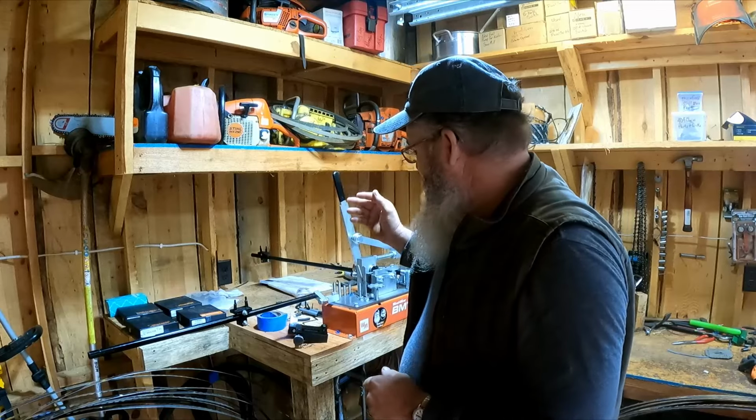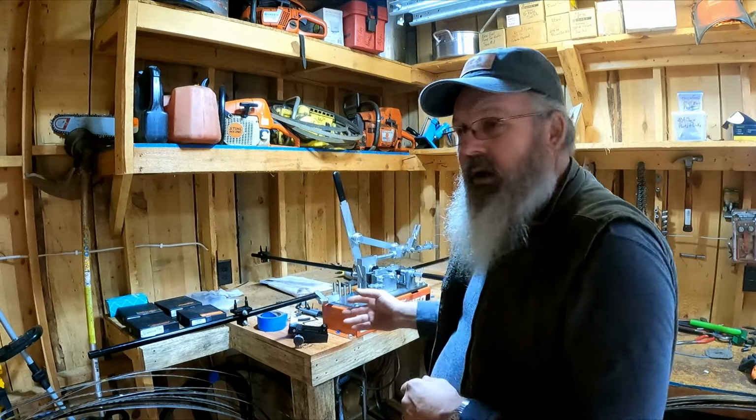But it's no different if you buy the BMT 250. I read behind guys that are having issues with it, and I hate to tell them, most of the time it's probably because they're resharpening a blade that got too hot and it's lost its spring tension. And when you bend it out, it just stays out. That being said, try not to overrun your blades.